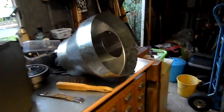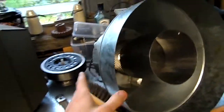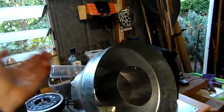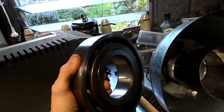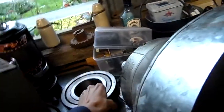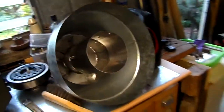So that's that. We do have another Siren in the making, slowly. This one's a slow progress, so it won't be videoed for a while, but this is a bit of a teaser too. Just trying to make a model of an ACA P15, a rotating one. I've got a rotator assembly happening from an old rotary screw compressor bearing. That's a big ball bearing race, called a thrust bearing. There's 2 of them on each shaft inside those big ammonia compressors. Because I used to do ammonia refrigeration.